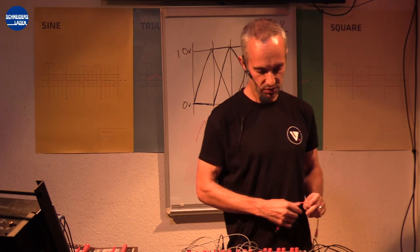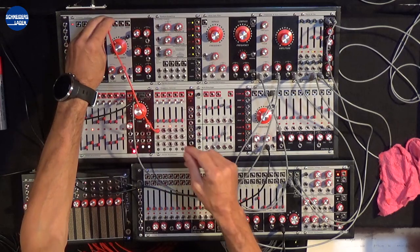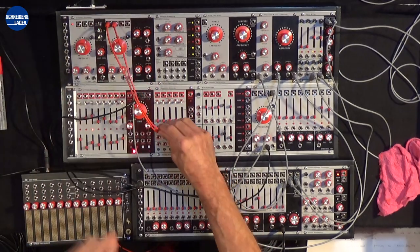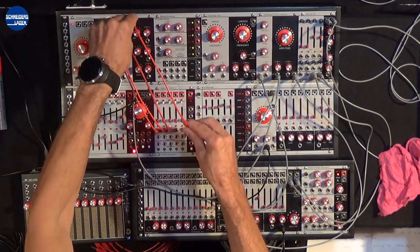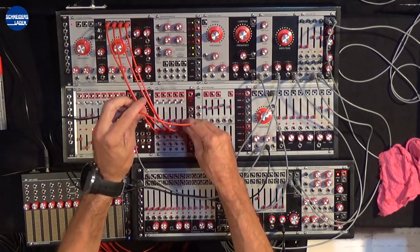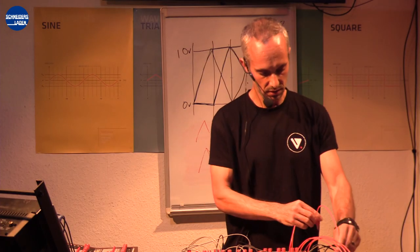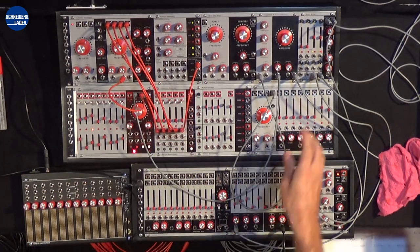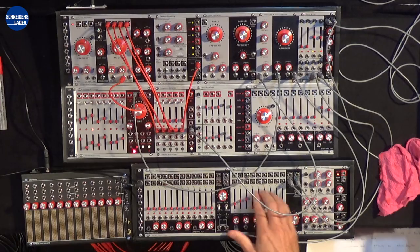So what we're going to do here is, rather than selecting between 5 different CV signals, we're going to actually put audio signals through them. In this case, to start with, we're going to put 4 waves coming out of the complex oscillator and 1 noise. And then that will be the primary sound source that goes into the amplitude and tone controller and goes out into the world.